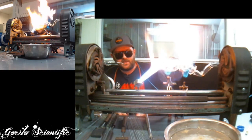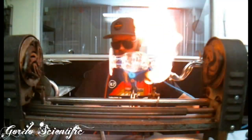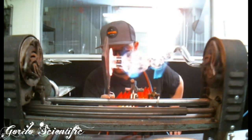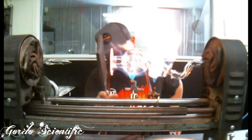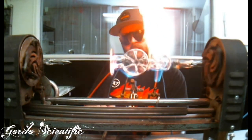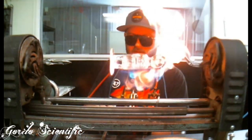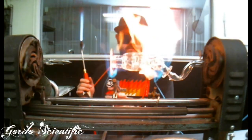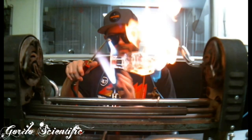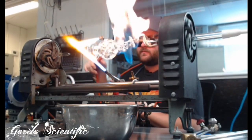I'm going to heat it now and get some of those tool marks out. I'll go for a quick flatten — not the final flatten — just to make sure it's staying on center. Then I'm going to clean up this divit. The way I flare feet, I tend to get a little divit on the seal pretty much every time, so it just takes a few seconds to clean it up. I'm going to thicken this up a little bit, and I think I am going to keep this one round — I've been preferring round feet recently, just because everyone is doing square.